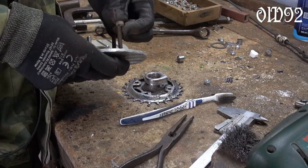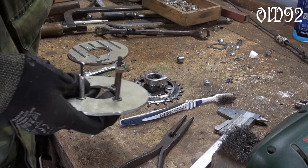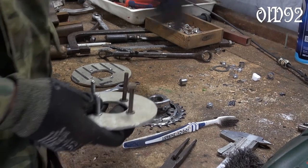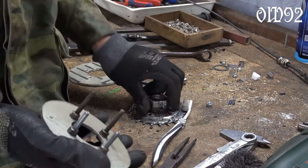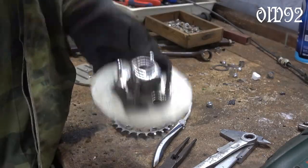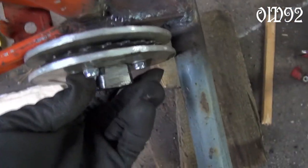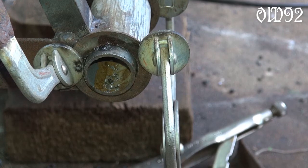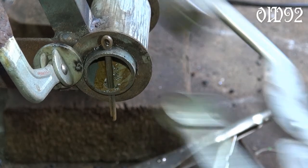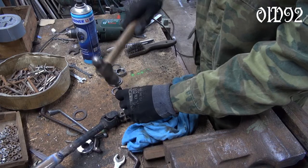Notice those black markings on the metal — if I'm not wrong that piece is actually from the second world war; I think it was some kind of target destination device. Well, I just needed some thick aluminum, and this one even looks great and has some history. Finally I was able to mount that pulley, but there were problems because there wasn't enough clearance for the bolt heads — I had to do some filing. I still had to attach a washer and a split pin onto my self-made rubber bearings from the rear axle suspension unit to secure it properly.